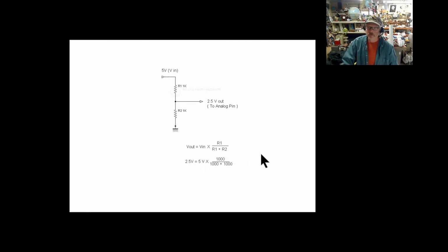So what helps for me though is I replaced this top resistor here with this CDS, cadmium sulfide photoresistor. And it varies the resistance according to how much light you get on it, okay? And then you can just assign a number. You can range it, how high and how low it's going to be, and say, okay, if the number's so high going up from night, it means open the door, it's morning. And the other way, if it's getting darker and darker, you can assign another number saying, okay, it's time to go to bed, close the door if everything's okay. So that's what I use to monitor the light intensity on the chicken tractor.